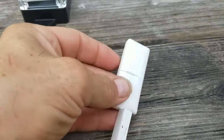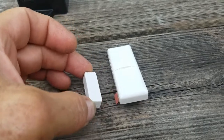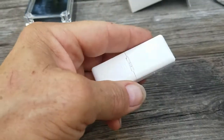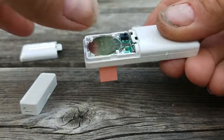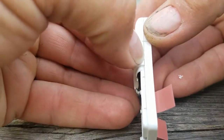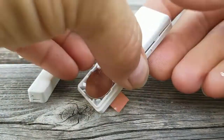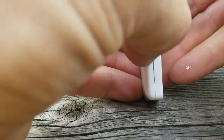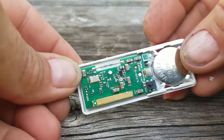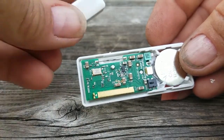The way that most of these door sensing devices work is a magnet operating a reed switch inside the sensor. It's quite easy to demonstrate. The window sensor comes apart by taking off the battery compartment and getting your thumbnail into the lid and popping it off. Here you can see the reed glass reed switch, which operates by the magnet coming in contact.